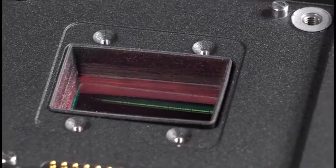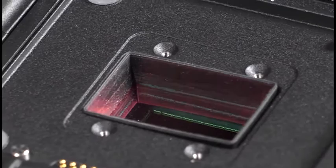When the Epic M's, the Epic X's, and even 1 or 2 Scarlets started coming out, we began noticing a strange type of flare happening with the camera. It's as if the light was hitting the CMOS sensor at extreme angles and then causing a strange type of flare. We figured out, or RED figured out, that this was due to light bouncing around inside the housing itself.